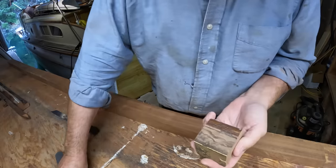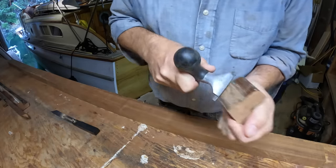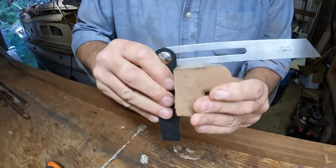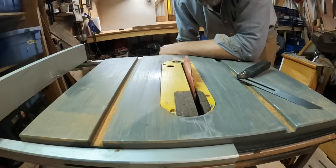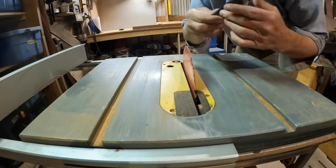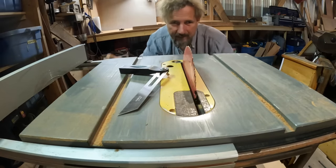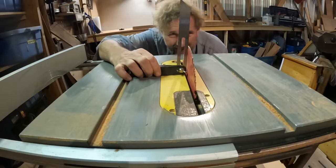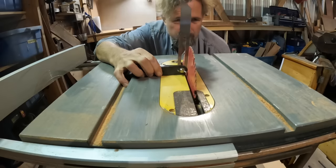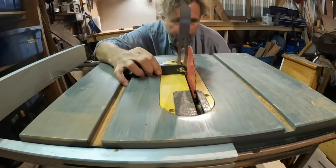Next, to determine this bevel angle — but before that, I'll make sure it's nice and smooth so there's no chance I'm measuring an inappropriate angle. I'll set it up on the saw. I'm going around the long way because I could just put the block against the blade, but I thought we'd go through the process of transferring it using a tri-square. So now I'm just going to loosen the bevel lock on the saw, tip it a little bit, take the tri-square and try it against the blade. It's critical that you have the blade out as far as possible so you have more length to work with. Also try not to let the tip of the tri-square sit on a tooth, which will be slightly proud of the face of the blade.